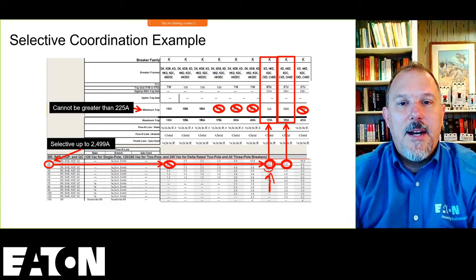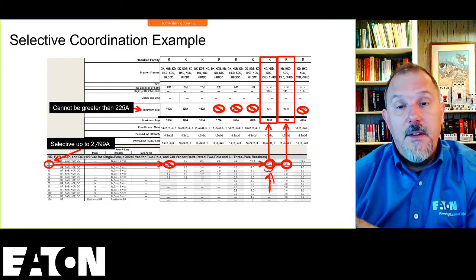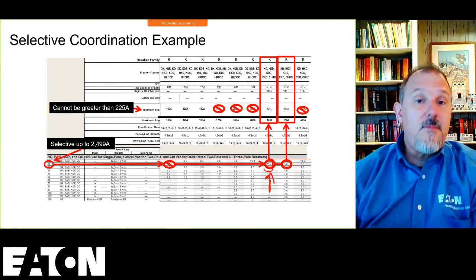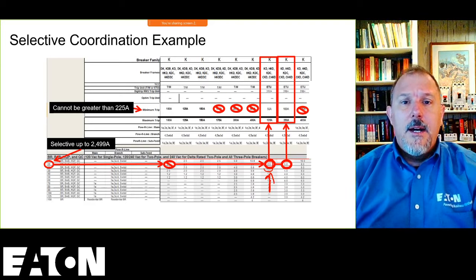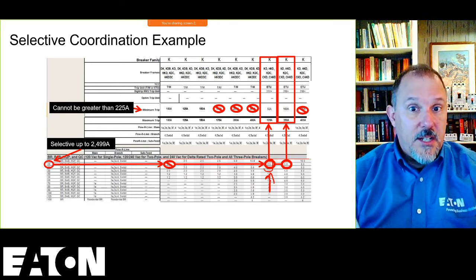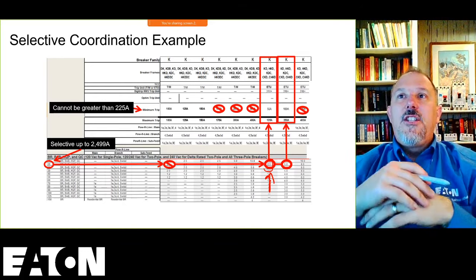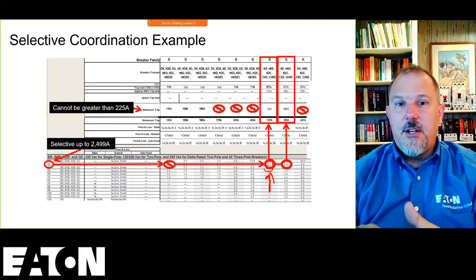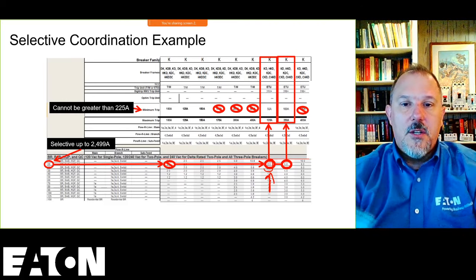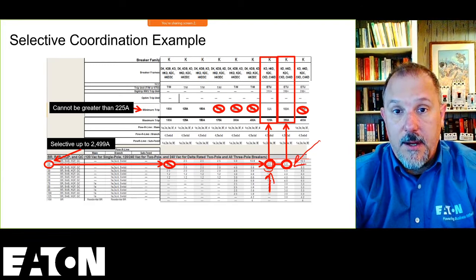So I could use my electronic trip unit, 125 amp frame. Now, 125 amp frame is going to be less expensive than a 250 amp frame. So if I was worried about cost, which we all are, we want to make a most cost-efficient design, I would use one of these two. I would possibly go with the 125. Now, that is pretty doggone close to 2,500 amps. I would not want to be using that because if my impedance goes haywire, then I am SOL, so to speak. So a safer design, a more flexible design, would be using the 250 amp frame breaker